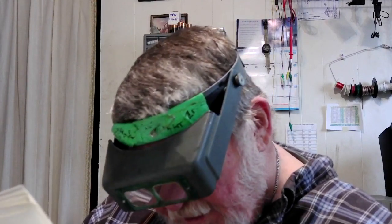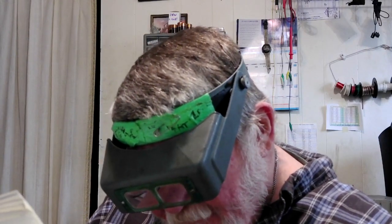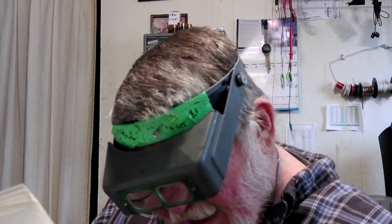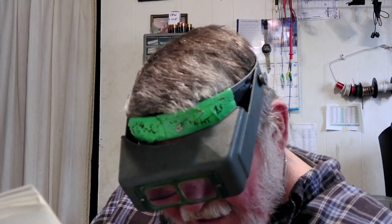Our intermediate frequency is still a radio frequency, it's just been knocked down to one intermediate range that we can use, one frequency that we can use. Used as RF amplifiers in standard broadcast and FM receivers, as well as in wideband high frequency applications. And it talks about the low value of the grid to plate capacitance is minimized, and it minimizes regenerative effects. In other words, it's not going to build up a lot and send off a signal, which could start it feeding back and creating a loop. So the good thing about this tube is it's very low in that, so it'll just send the signal out.